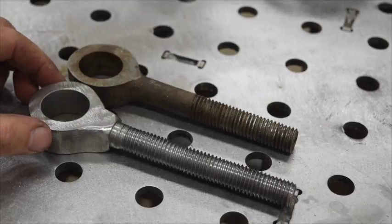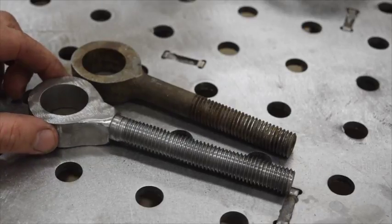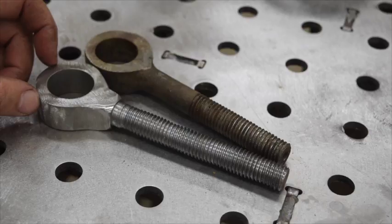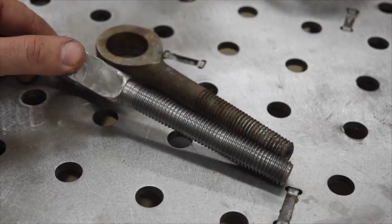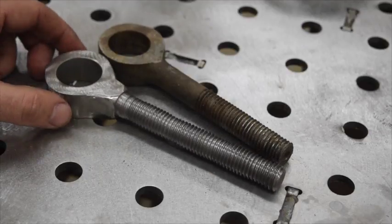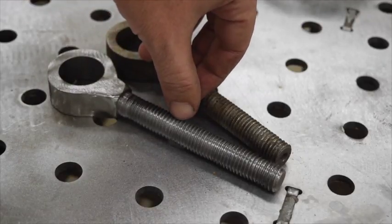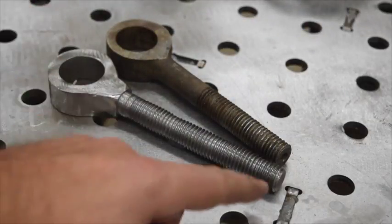I've got this part finished up. I can't say I'm in love with it. I had a metric die — that was the only die I had that was big enough. In the die set it shows the metric version and the SAE version in the same die, and I thought maybe it's somehow adjustable, so I ran it over it. It wouldn't work, so I ended up having to go get a 5/8-11 die and running over it again. And what it is, is a couple of spots here and here where it cut the tops off the previous threads and makes it look kind of funky.